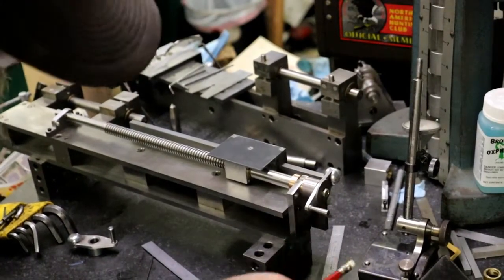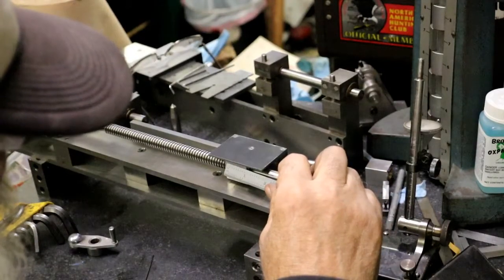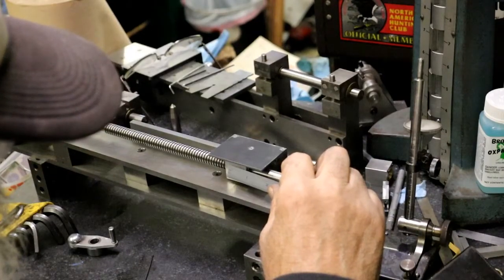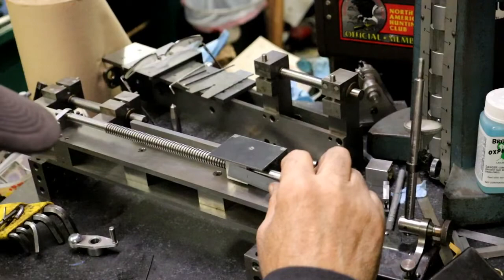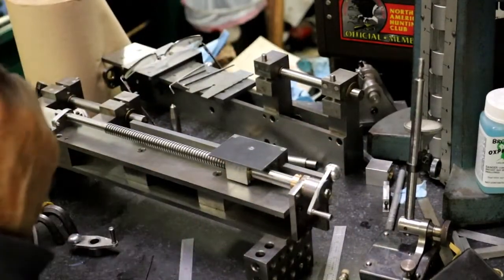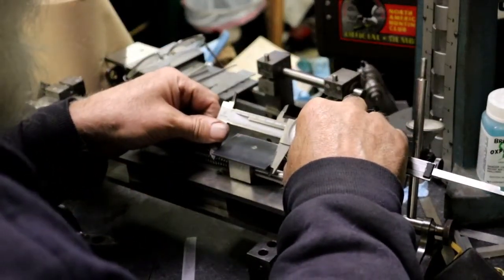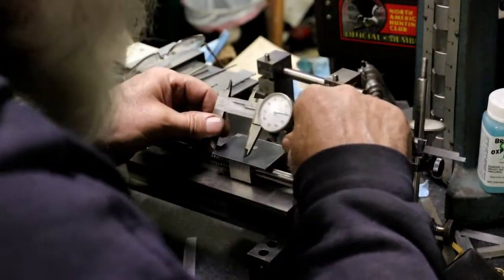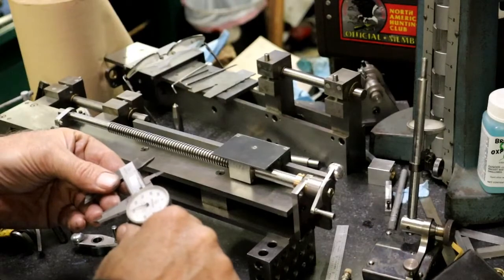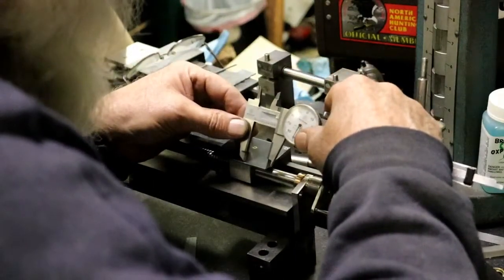All right. So now from 485 over, I want to go 300. Yeah, 300 over both ways. So we'll go 300, 300. And this was 1 inch 250, so 950. And that would be the center line of the holes here, and the center line of the holes here.